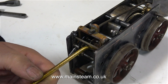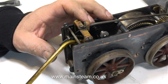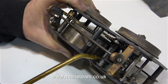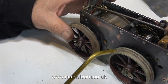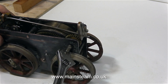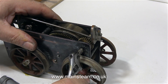The wheel at one side is okay; the wheel at the other side has sustained some impact damage at some time in its life — that's why it's not running true. Now that the white spirit has evaporated, it's time for some oil. This is my normal oil mixture for general purpose lubrication: the mixture is 50% steam oil, 25% machine oil, and 25% rapeseed oil — or canola oil that you buy at the supermarket. I use the rapeseed oil as an anti-friction additive and it seems to work quite well. There are plenty of points to oil on this engine and they haven't been oiled for many years. According to the one instance I found online, this gauge 3 engine dates from around 1910.